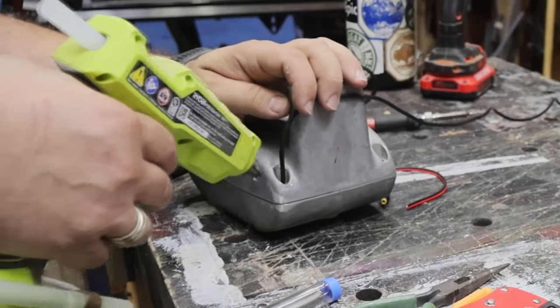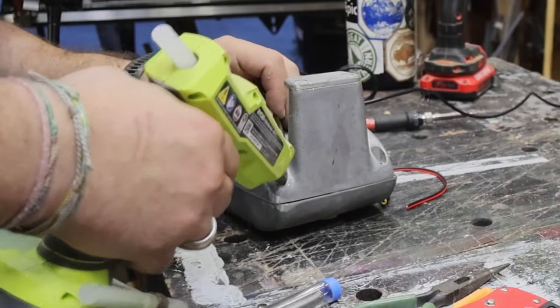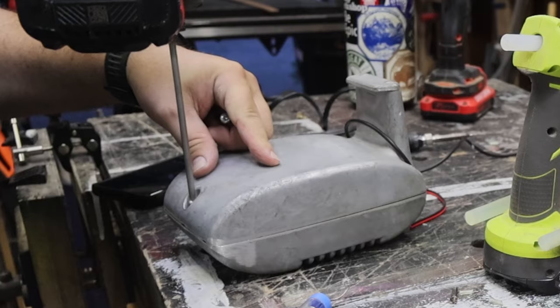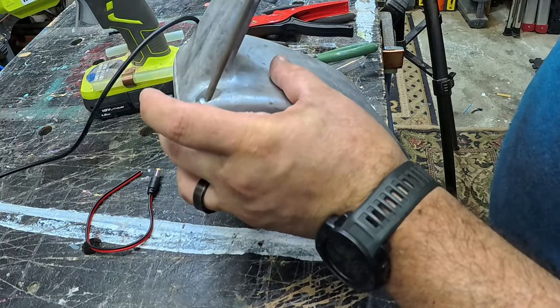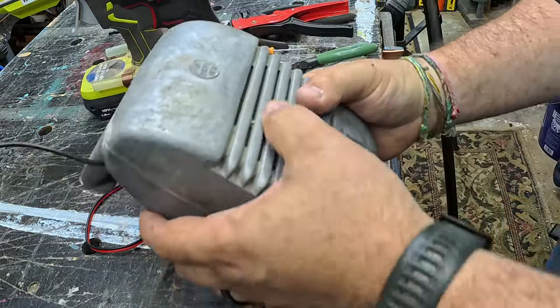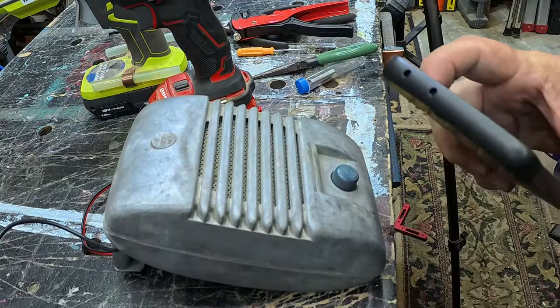Where the power cable comes out from the back of the speaker, I'm just filling that in with some hot glue to make a little more waterproofed tightness. Then I screwed back on the case using some different screws which had a Phillips head, which are a lot more accessible and better than the other screws with the needle-nose pliers, because I just don't think I can get that tight enough on there to make this as waterproof as possible.